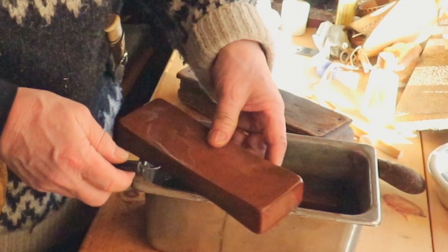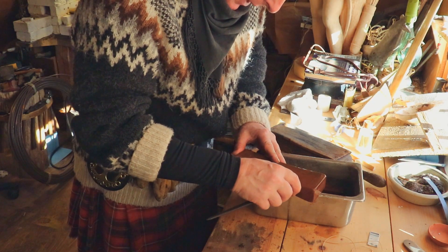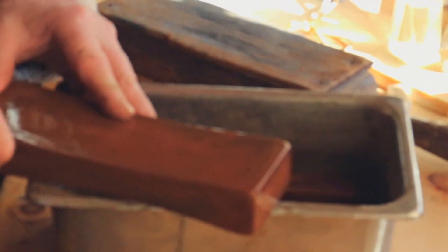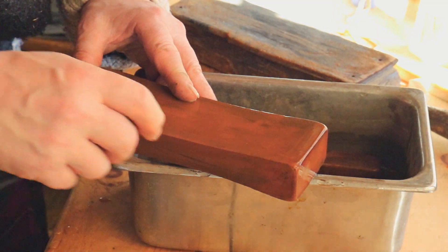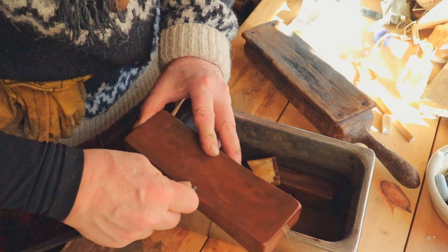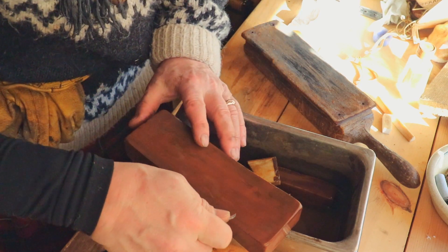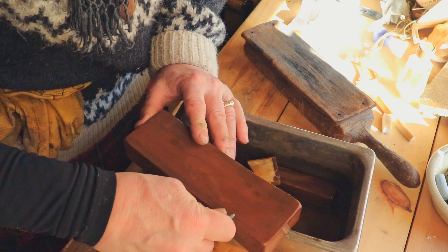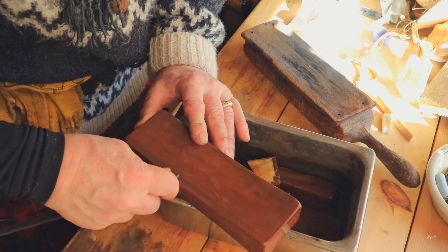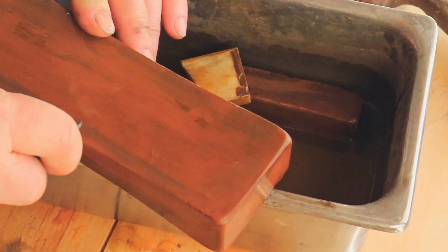Back to the water stone — and this obviously has a knife grind, so I'll be honing down both sides, creating that feather edge, a little thin thread of steel. I'm relying on the sheen, the reflection. This coarser stone makes it look grayer, less shiny — I can tell I need to do the edge more.